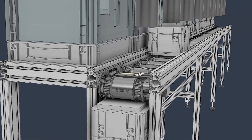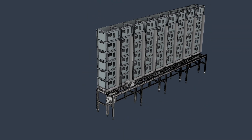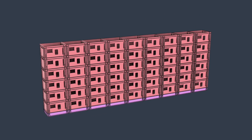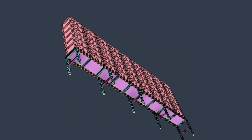This is the main assembly of the entire thing. We can look at the individual components separately. These are 54 feeders — they are simply stacked on top of each other, placed on a layer of power supply and data modules. Based on a fantastic comment from Chris Rockstar under the last video, by using a few low profile boxes we can consolidate power supplies and power a single stack of feeders with a single power supply, which reduces cost for the test setup.